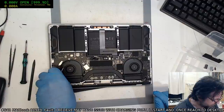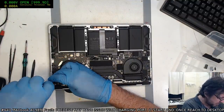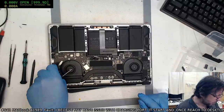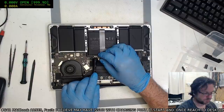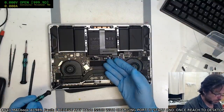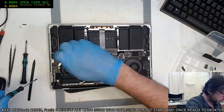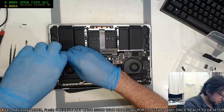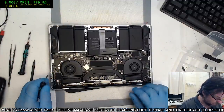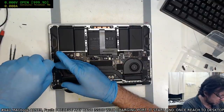And I can't imagine that they would have done it for preservation of, how do you say, connection sequencing. Because it doesn't really seem like something that Apple would truly care about. What I mean by connection sequencing is to ensure that first the battery is connected on the plus and minus, and then connect the data lines, which will actually then talk to the battery controller and say, okay, now you can let your power through. It just doesn't really seem like something that Apple would care that much about. Yeah, maybe it was. Maybe one of the engineers said, look, we need to guarantee that the battery is physically connected before we even consider activating or talking to it. Could be wrong.